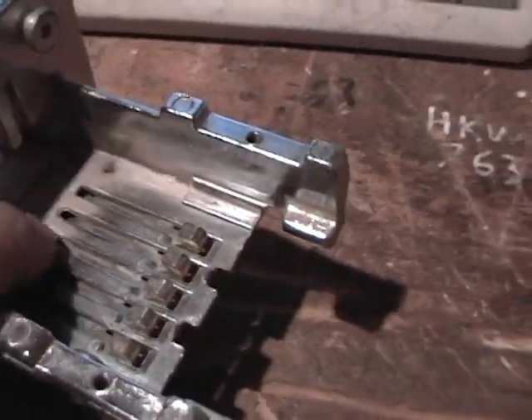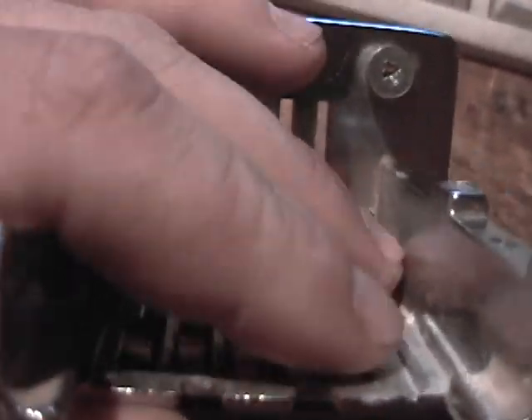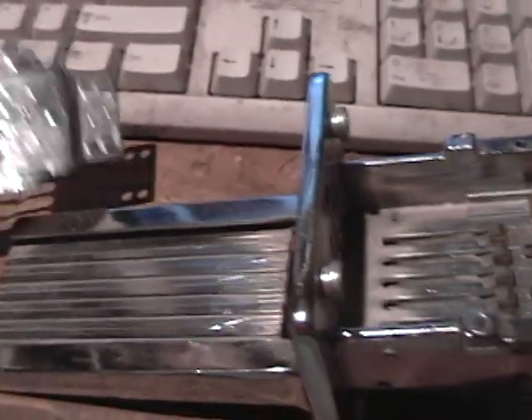Like the one over here — it has two slugs in it, so it's set up for $0.75. What that does is, if you see, the slug would stick down further than these. And the way it works is when you push it in with no coins in there, these little fingers right here will catch on the edge of these and stop it. Now, if there's coins in there, the coins will push these fingers down and allow the whole thing to slide.